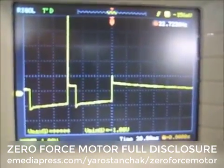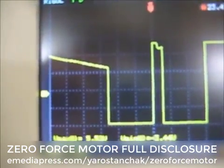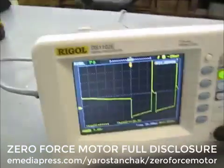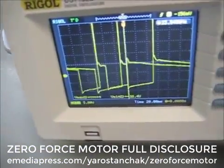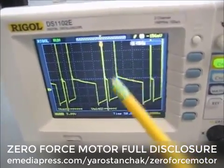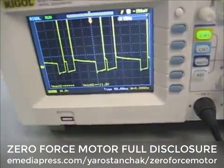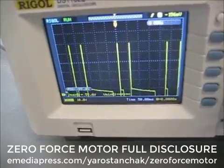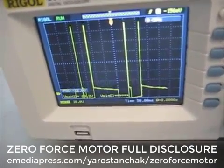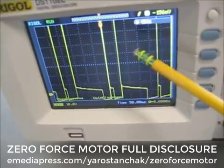Let's move this GoPro down and get a better look at this wave. Sorry about the glare on the screen — it's the lighting in the shop. You can see where it switches on, and since there's nothing to counteract the radiant, you're at 10 volts per division here. So we've got about 10, 20, 30, 40, 50, 60 volts.